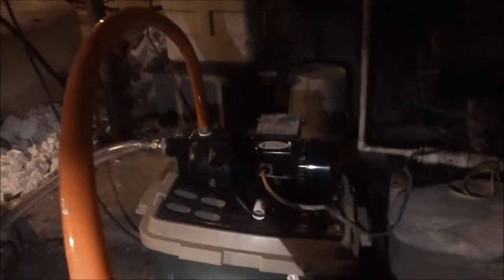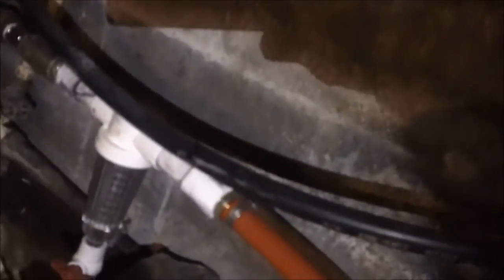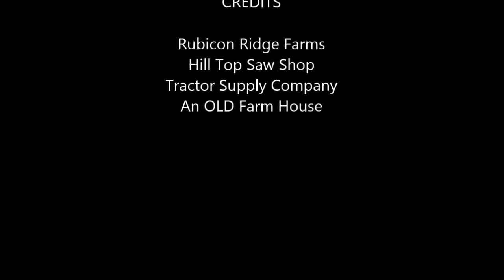I've got someone taking a shower upstairs, so we're going to sit and watch the system cycle to make sure everything is working good. What I did was: got a 200 gallon tank, low pressure hose to the intake of the shallow well jet pump, then PEX over to a filter, then into the old system — I put a union in there so I could take it apart. PEX to PVC, filter system, check valve, and a union. Let's see if the pressure drops, the pump turns on, does a cycle and everything. That's a good thing.